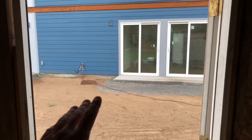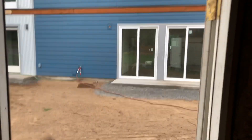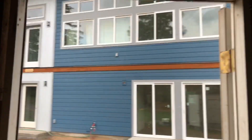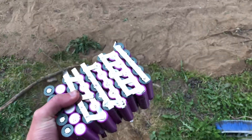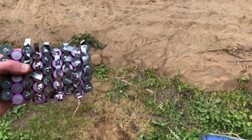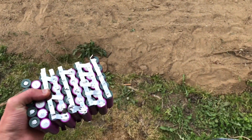We've been moving in and out of places because the downstairs of our house is still being built — that's where my room was — but since we had to stain the floors I had to move out. So I'm currently sleeping upstairs. Anyway, I had to move all of my shop stuff into this shed and I still have to run power out here to use it. I recently bought a spot welder for about a hundred bucks used so that I can make my own batteries. I've been making them for friends for electric bikes, and this is an example — some 18650 cells spot welded together with nickel strip. This pack is only about a third done; it's going to be two or three times longer than this and it'll be a 72-volt battery pack.